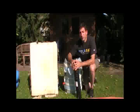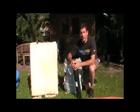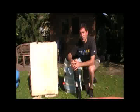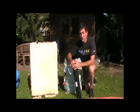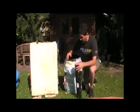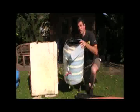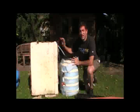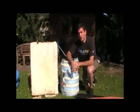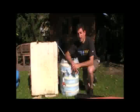That was the myth that was perpetuated, and those of us who lived in cities and urban environments and had no experience with solar hot water tended to believe what we heard. It wasn't until I was an adult working on my PhD in Cairo and started building my own solar hot water systems that I realized this was just a myth. In fact, if you took even a plastic tank like this one that we experimented with here in Germany before we went to Cairo, and you insulated it with styrofoam, then you kept the heat of the water within 5 to 10 degrees of the temperature it went in at — the following morning.